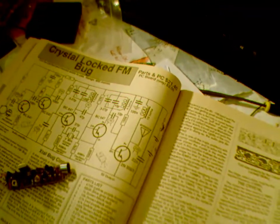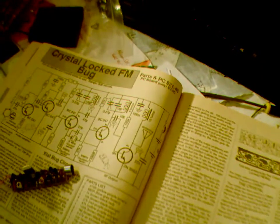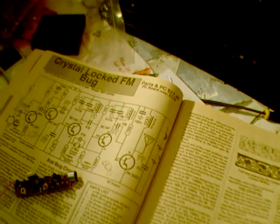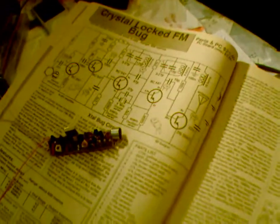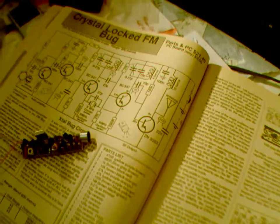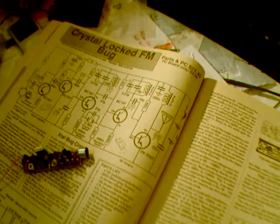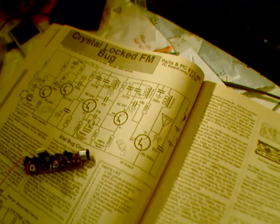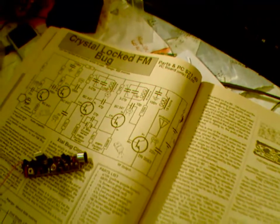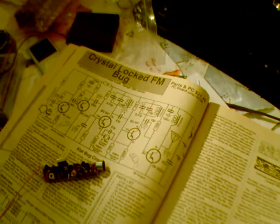Okay, what's this? A few questions here. Have any advice for self-build variable capacitors? How much picofarad for a 20-meter magnetic loop? For a 20-meter magnetic loop, I would say off the top of my head, about 100 picofarad, but it really depends on the size of the loop. Like if it's a big loop, it might only be 50 picofarad. If it's a small loop, 200, but by the time it's 200, it won't be very efficient. So my guess would be around 100 picofarad.